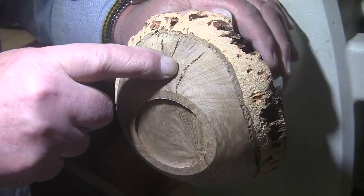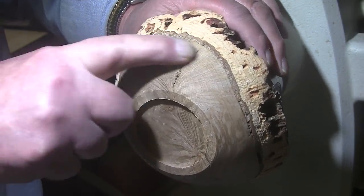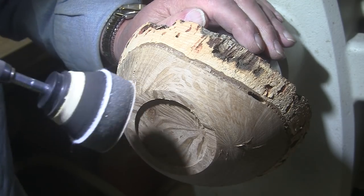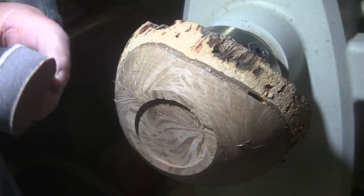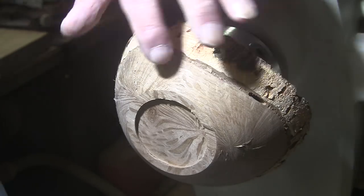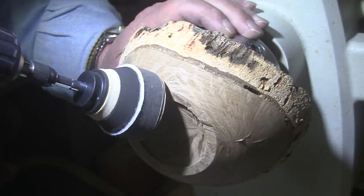You can see the fibers of the wood because of this crack — they all go that way. That's because the chisel is out here cutting the wood and pushing those fibers that way. So when I sand in reverse, the piece is spinning away from me, and I'll have my two inch disc sander sanding down against it with the leading edge. I can pick those fibers up and cut them off. Even without cracks the fibers are still going that way — I'm just showing it because you can see it so plainly here. That's the reason to sand in reverse.